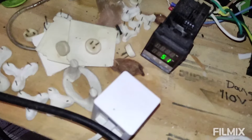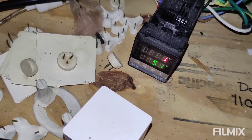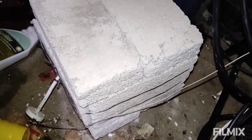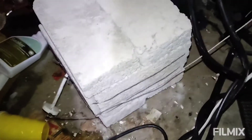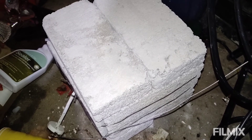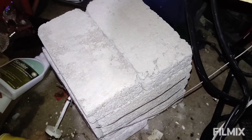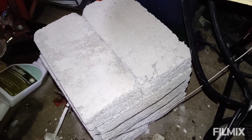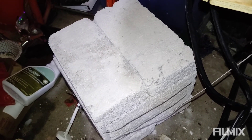The new kiln has been sitting at 51°C — around 124°F — for the walls. I'm going to go ahead and bump it up to maybe 80 or 90°C because I want to cure out this fire brick. I don't want to get it up to full temperature just yet because I don't want to break it, but I want to get all the moisture out. I'll warm it up, let it sit at 80°C for a couple hours, then turn it off and try to bring it higher tomorrow.